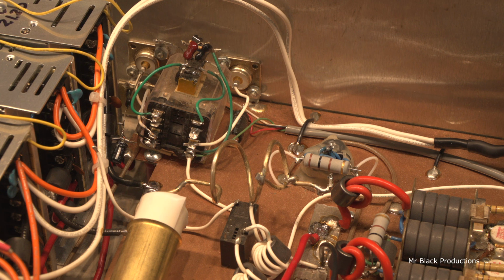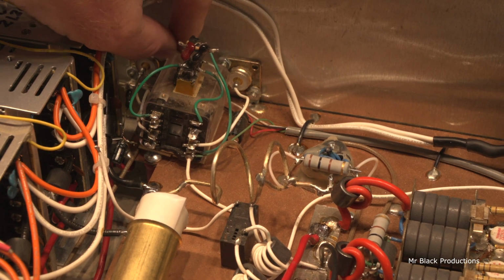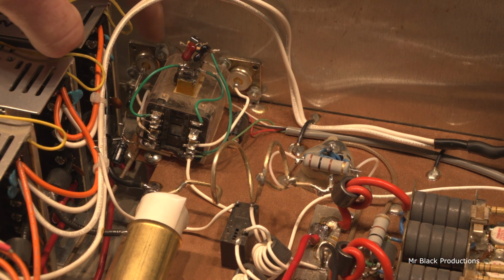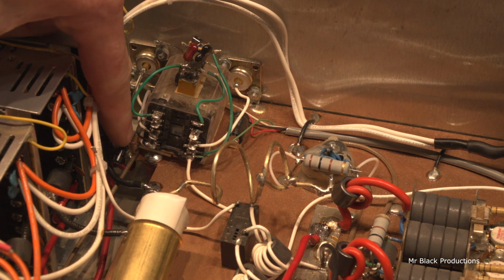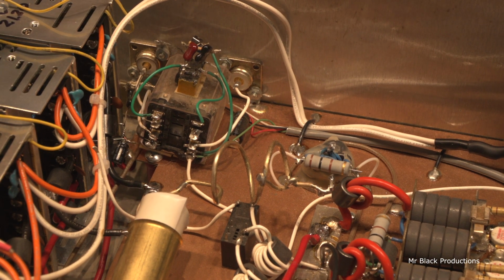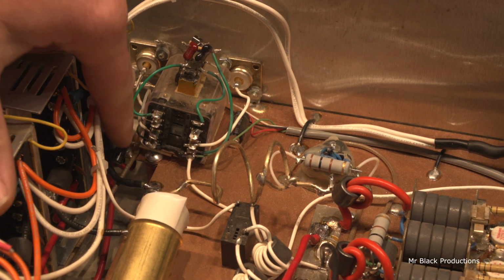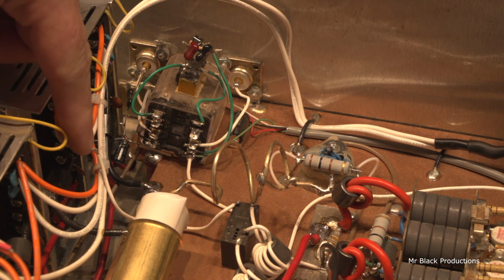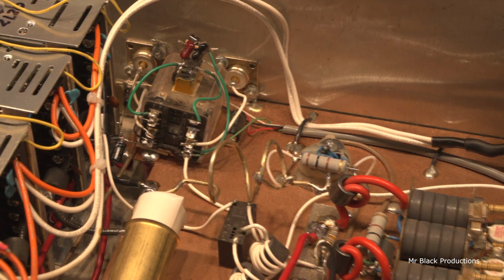Oh, well, hold on. So I had him take the lid off, and he sent me some pictures. Now, over here in the corner, because the relay came off, the preamp ground lead also came off. But the main reason that this thing wouldn't key up is this wasn't hooked up. Now, the amp would have worked. I disconnected this, by the way. The amp would have worked if he could have seen to solder this onto here and then hooked up this one wire. So this wire popped off, and let me zoom in here.